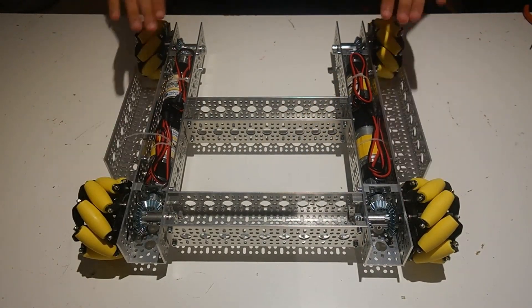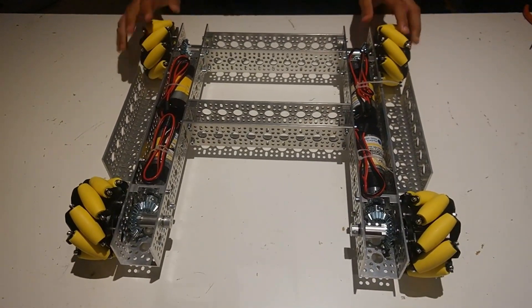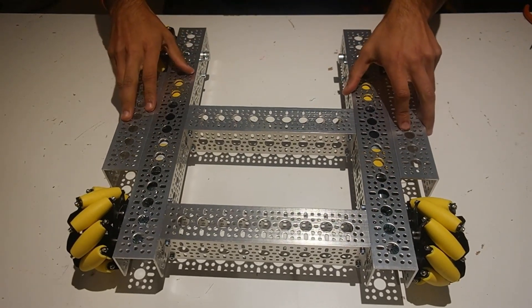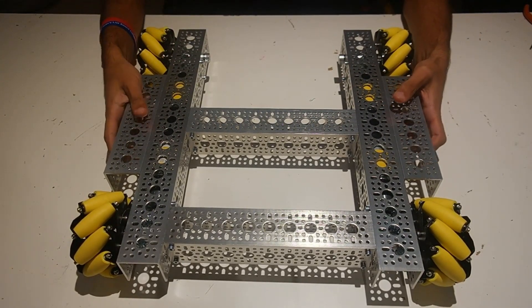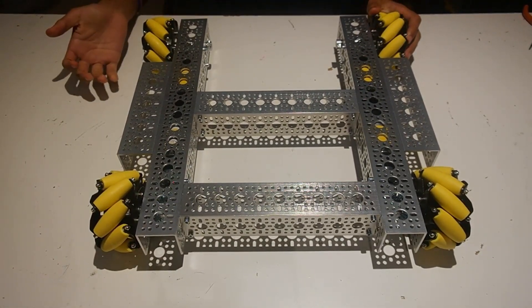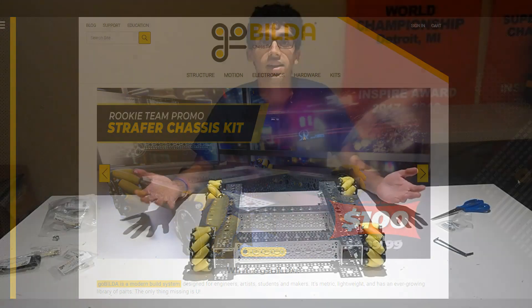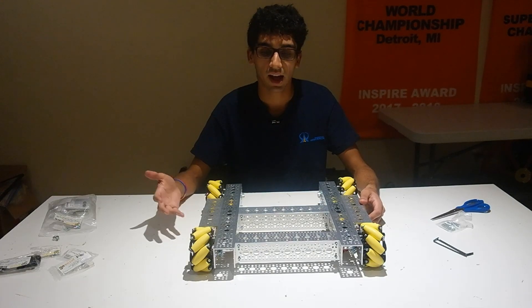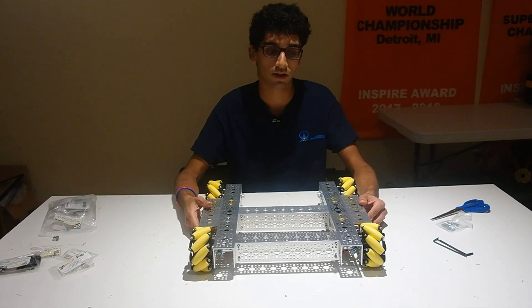With all four wheels and all four bevel gears installed, because the chassis is upside down the entire thing just spins around due to the orientation of the Mecanum wheels. Flipping it over onto its right side, you can see the X pattern the rollers make, which allows it so it doesn't spin freely and it can't move without the motors actually moving — you can move it forwards, backwards, left and right. It's overall a great chassis to use. We'd like to thank our sponsor GoBilda for sponsoring this video. In the next part of this video series, we're going to cover putting electronics on and building the odometers and putting them into the drivetrain so you can get your drivetrain up and running.